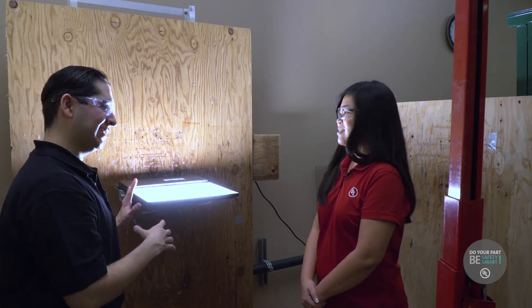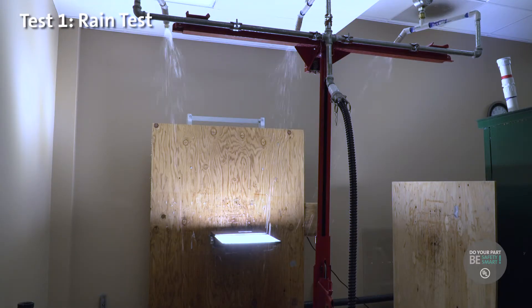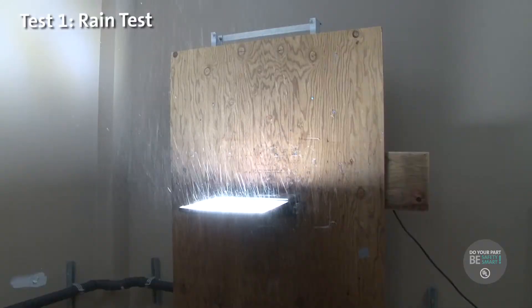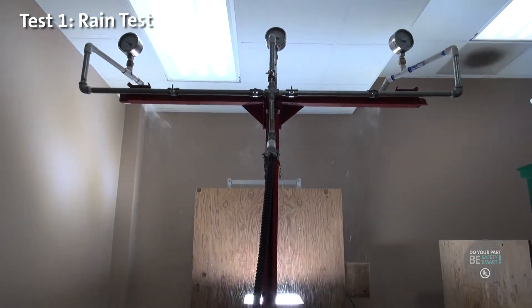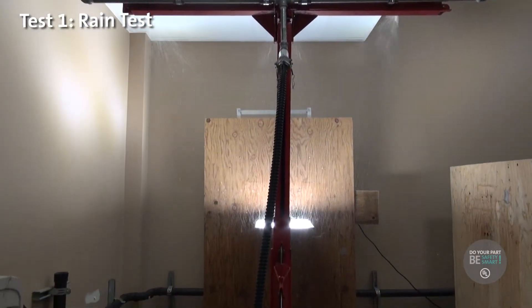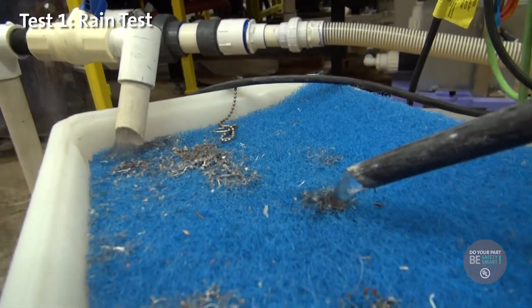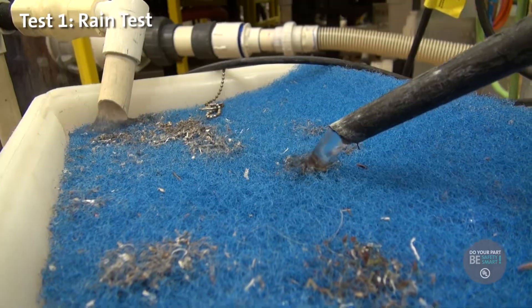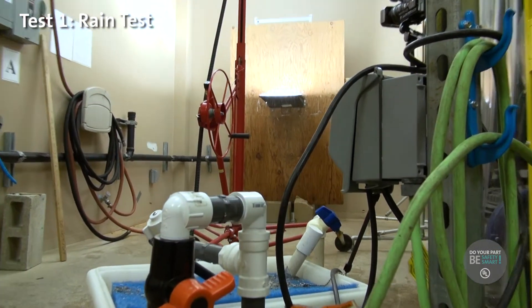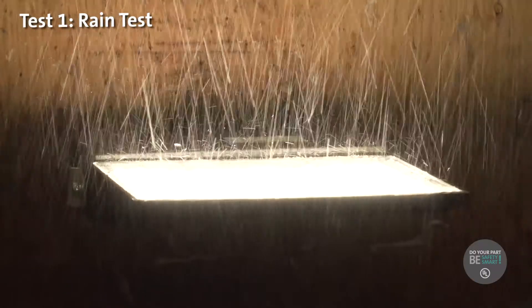So this is all just to make sure that if it rains, people don't get hurt or this doesn't catch on fire — correct? Yeah, definitely. This plastic lens here has a gasketing inside, so we want to make sure that even though there's water pooled on top, it doesn't seep into the luminaire and cause an unsafe situation. Now, is it okay if we go ahead and run this test? Sure, of course. We are only going to show this test for a few seconds, but normally this rain test runs for four hours. The water is pumped from a drain, which sends it back to the pump to conserve water. Kathleen follows a timing sequence for turning the light on and off and turning the water on and off to see if a change in temperature allows water to seep in.